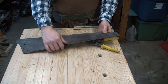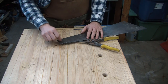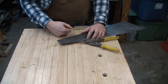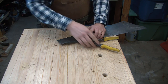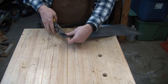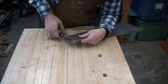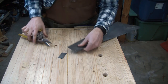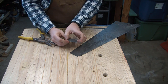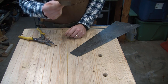There are a lot of different ways to cut the blank — you can put it in a vise with vice grips and bend it back and forth until it snaps, or score it and snap it. But what I like to do is just take some tin snips and cut it. I usually keep a piece about an inch wide by about an inch and a half to two inches long — that doesn't really matter because I'm going to be completely shaping it in a moment.